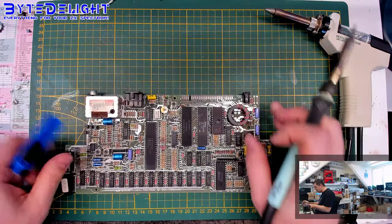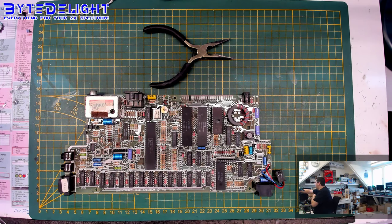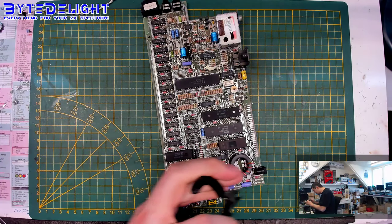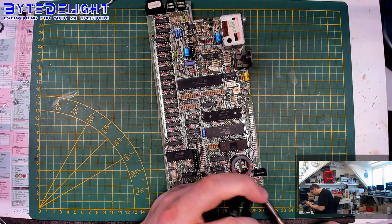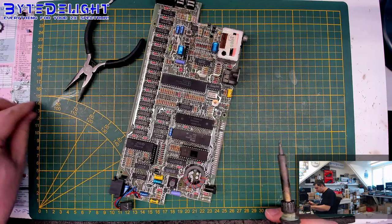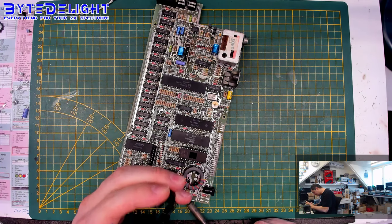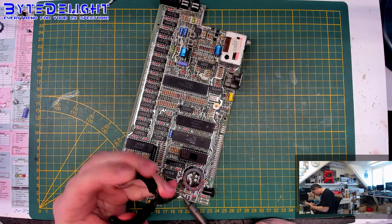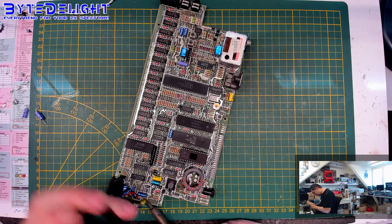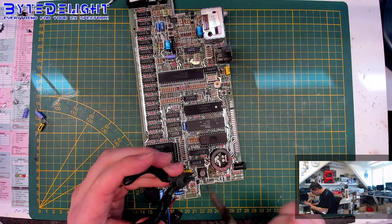Don't wait any longer. Alright, so now we can grab them from the top with a tool. Let me put this back. We don't need it anymore. Let's get these parts out. And again, since I checked the capacitor map, if it corresponds to all the locations and orientations of these capacitors, I can just pull them out without looking any further, because I know where to put them in by using the capacitor map. I think I forgot two here. We'll do that in a minute.